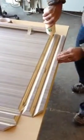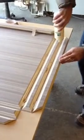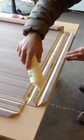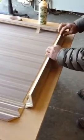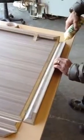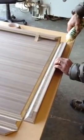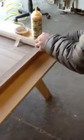To glue it up is fairly simple. You lather up the joint and get some glue right down into the apex of that joint, then just wiggle it back and forth a few times and it will distribute the glue throughout the joint. He's already got that far side kind of taped down. To work the corners, it's really just finger pressure and clamping tape.